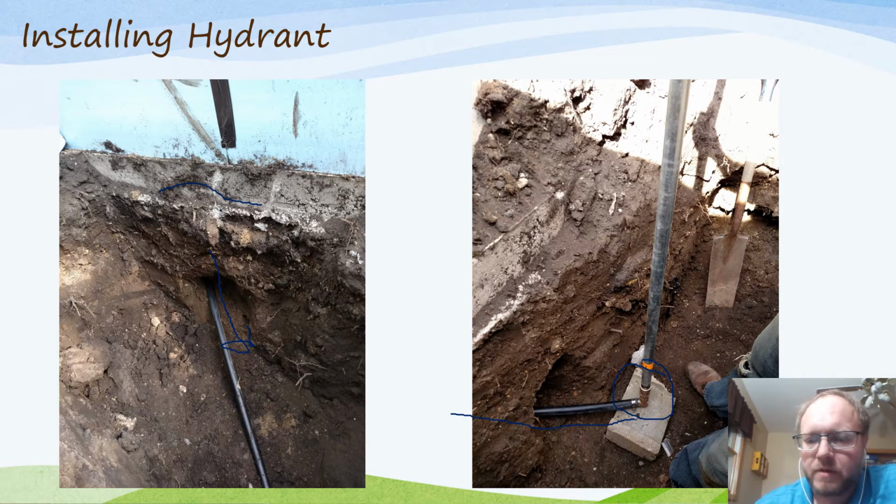And I found that it's easier to start downhill and get this stuff in place before you dig your trench up to the spring, because once your trench hits the spring, all that spring water is going to run down your trench if it's open and make a really big muddy mess, and you'll have a heck of a time dealing with the water that continually fills up the trench, sometimes faster than you can pump it out.